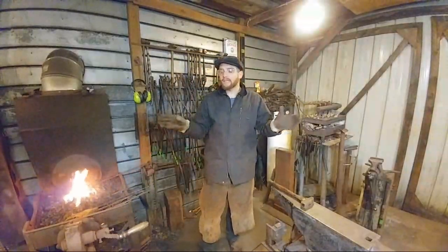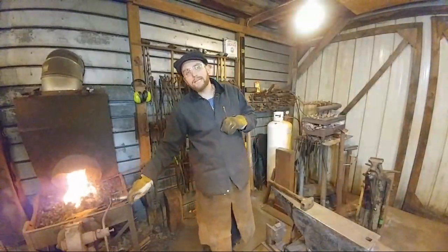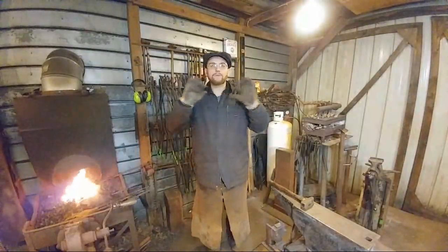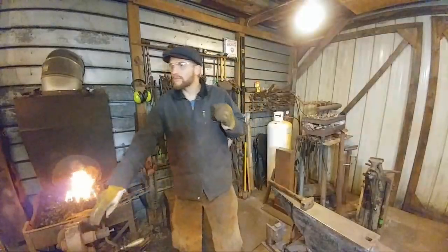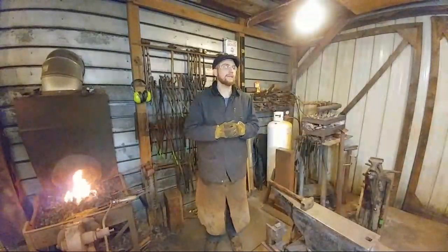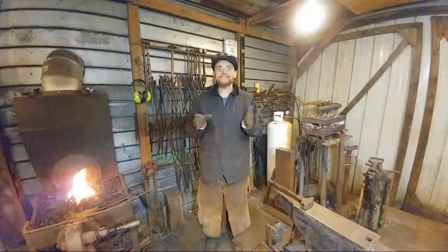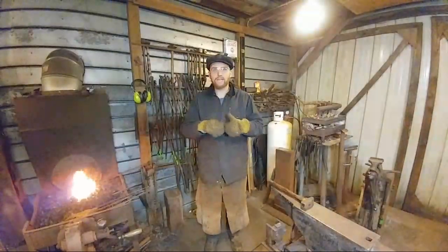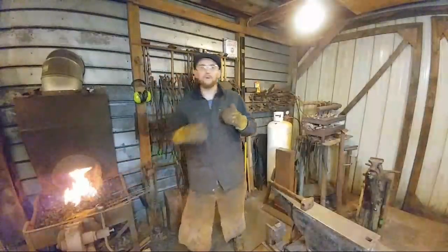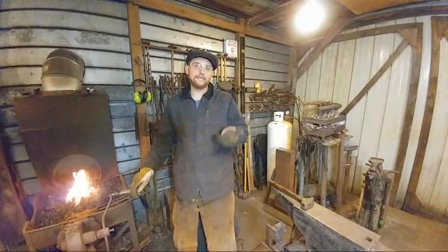And it can get up in the air. So I haven't made any current gas forges, but ones I've made in the past, I never put a rigidizer on there. One of the options you can do, I believe at Home Depot they sell like a 3,000 degree cement that you can put over that K-wool, and that will help rigidize it without spending a lot of money.